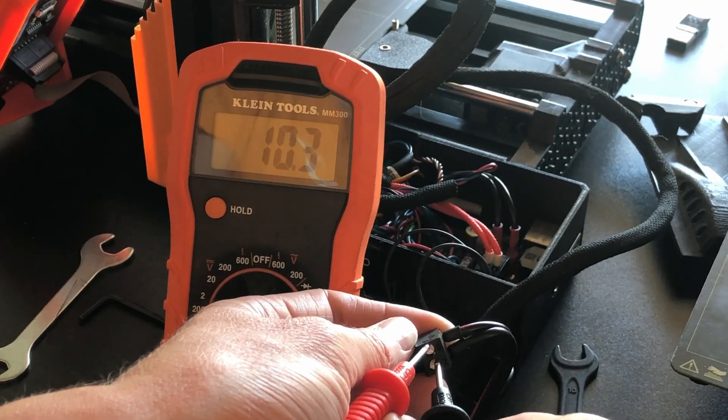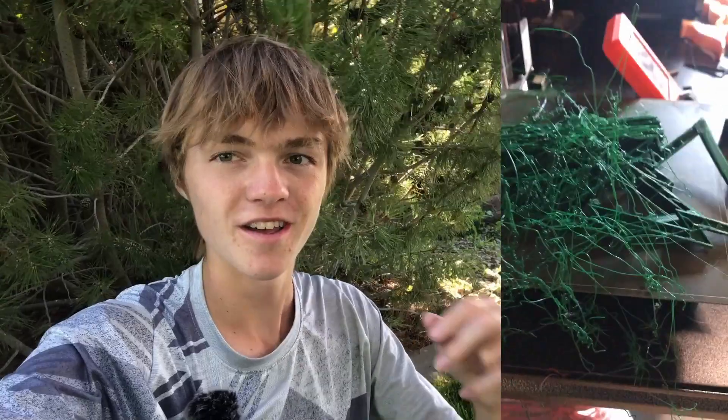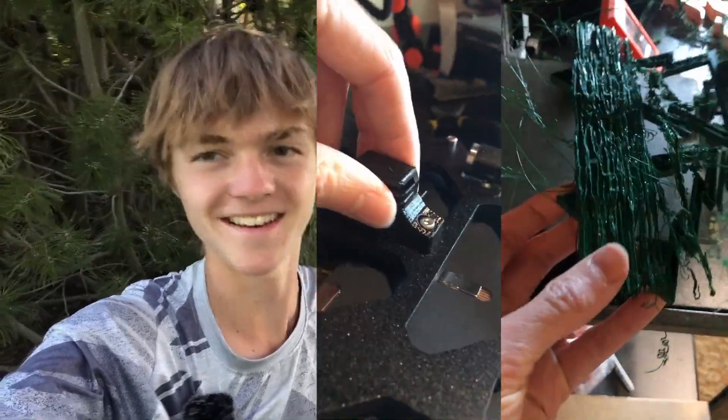Those are the most common issues I've had with the Prusa Mini. That last one is more of a fringe case — most issues with the Prusa Mini are a one-time occurrence or ones I don't really see. There are a lot of issues I've seen online that I've never encountered; those are just the most common for me. The wire issue I've had three or four times, which is really annoying. There are even a couple weird ones where the bed mount actually fell off. As far as nozzles, I don't really have to replace them since I'm mainly printing with PLA and it's not very abrasive. The PTFE tube is really the main thing to be aware of with the Prusa Mini. Hopefully this video has helped — I'll see you later. Bye!